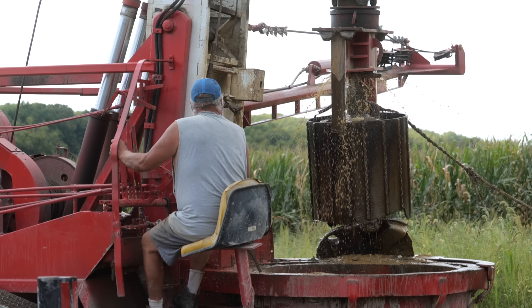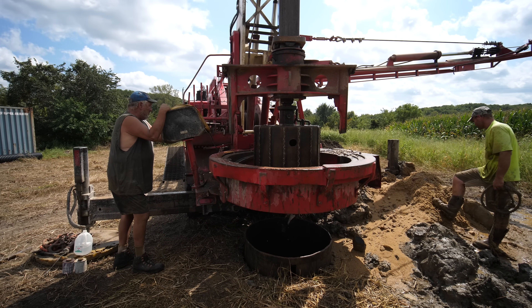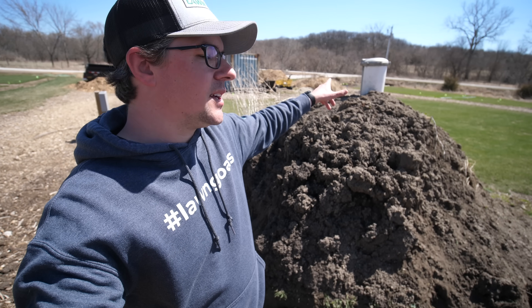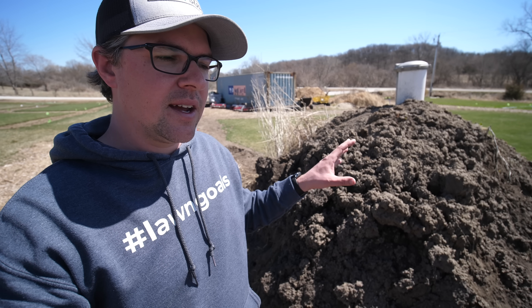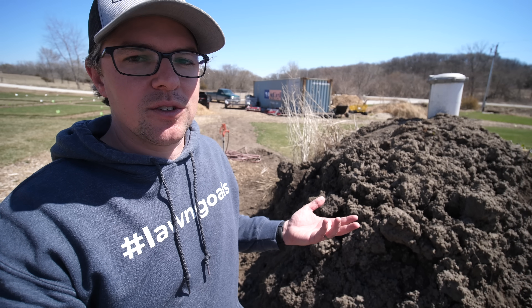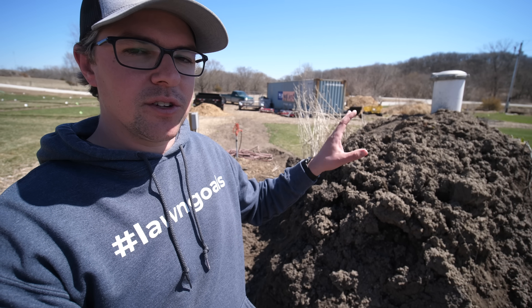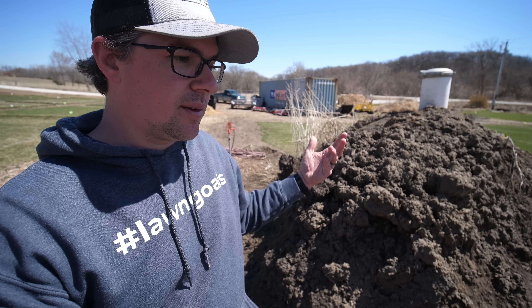That left our well for irrigation purposes or as a backup system. This well is only about 35 feet down - it's more of a well that was just dug down until they hit rock. We already had pretty good water at that point. It's an 8-inch casing, producing somewhere around 20 gallons per minute on the best side. I would have loved more water than that, but you never know what you're going to get. It's been good enough last year for all my plot watering.